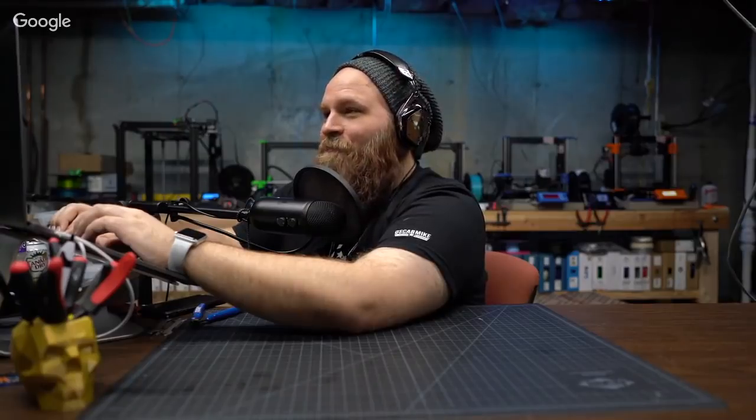Hey, what's up, Phil? All right, I think I have everything going. I have this printer. It's the new Ender 5 with Duet Maestro on it. I don't know if you've been following that one, but that one is all up and running. I only damaged it slightly, crashing the nozzle into the bed because my Z offset was much too high. So a new bed will be here tomorrow, but it works.